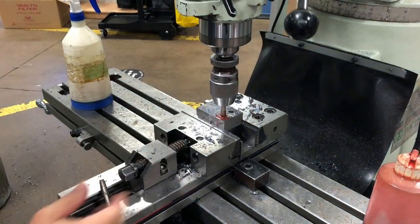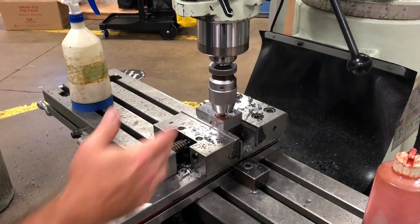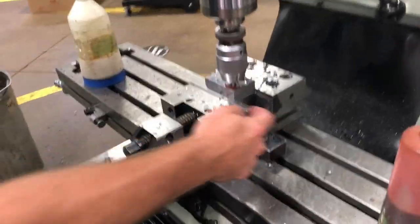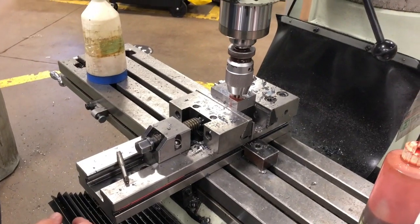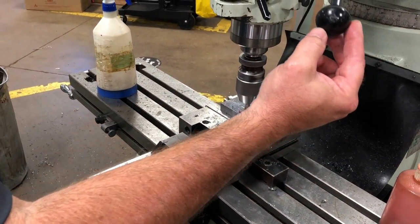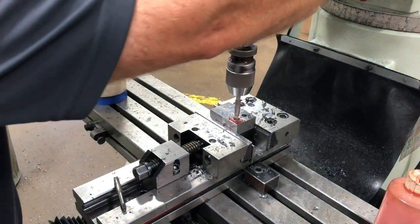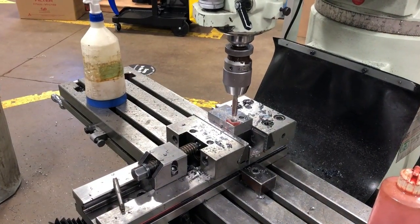Let it go down, stop, let it coast. I'm all the way through the block — check the side, all the way through. Then spin it in reverse. I want to keep it going up at the same feed rate because I don't want it to spring up, as on a finer thread that can damage the thread. Very simple.